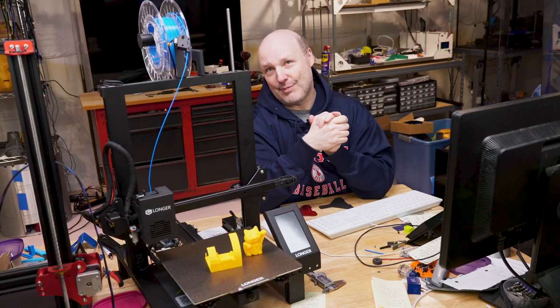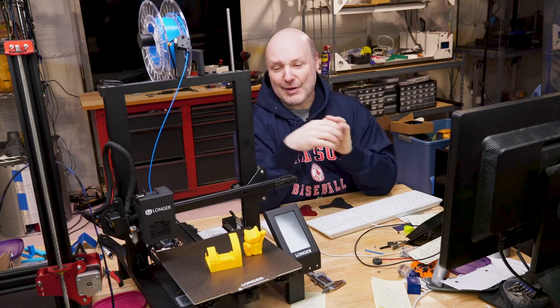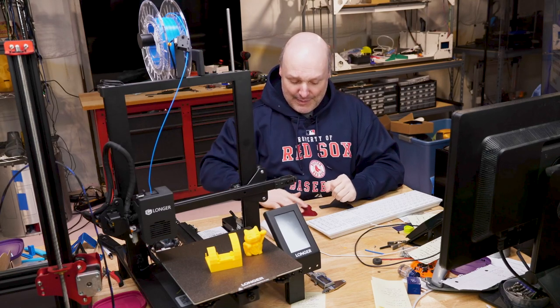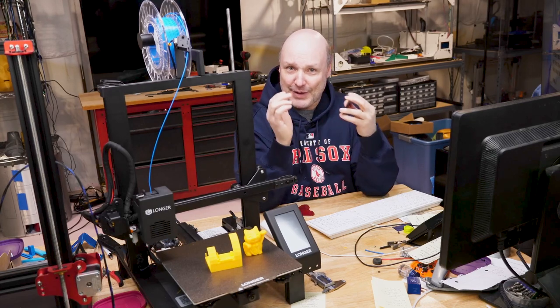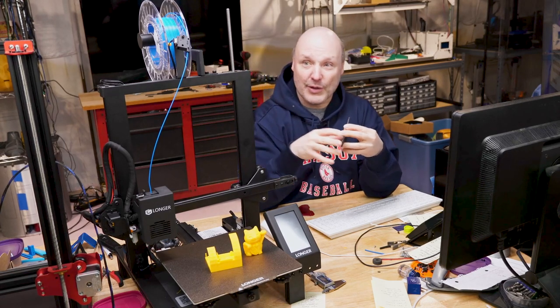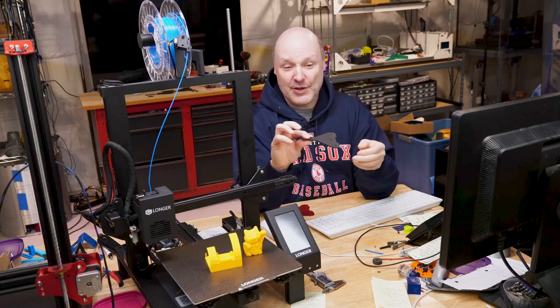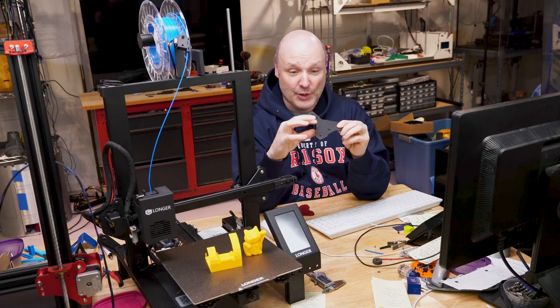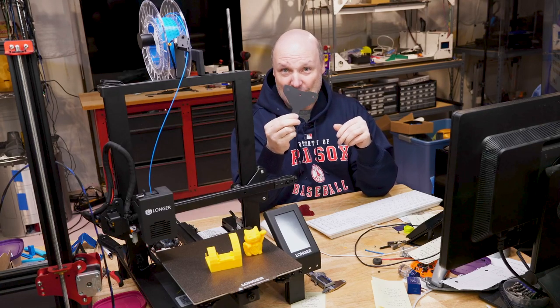But Paul took the hard road. I was suspicious about the stock plate — the fact that I could not make the V-slot wheels all make contact, fit together, and stay snug baffled me. So I was starting to suspect that maybe my plate was a little warpy or something was up with that. I wanted to consider this bad hardware.